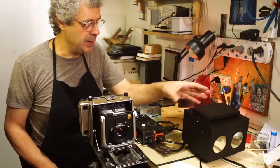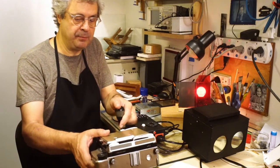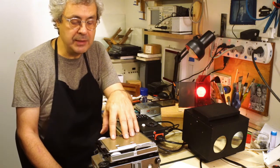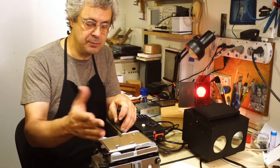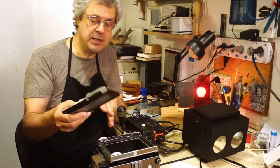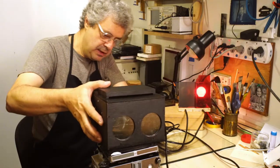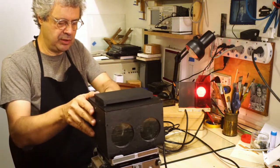About the box itself — the shape and the geometry of the box — it was made in a way that it can be fitted to a large format camera for a quarter plate camera. That means a camera using either 4 by 5 inches or 9 by 12 centimeters film format. I thought especially about cameras from the last phase of film photography having a Graflock back — many brands marketed cameras with this system where you can easily remove the ground glass, and I built a box that can be easily fitted in here. The box is firmly secured with the latches.